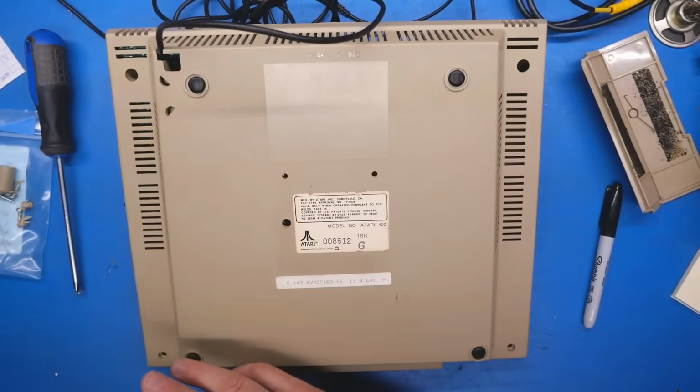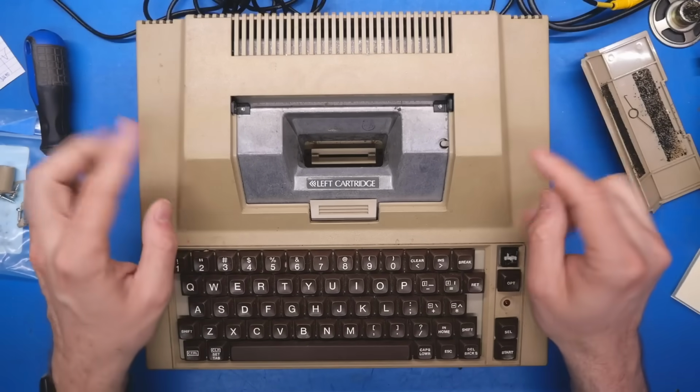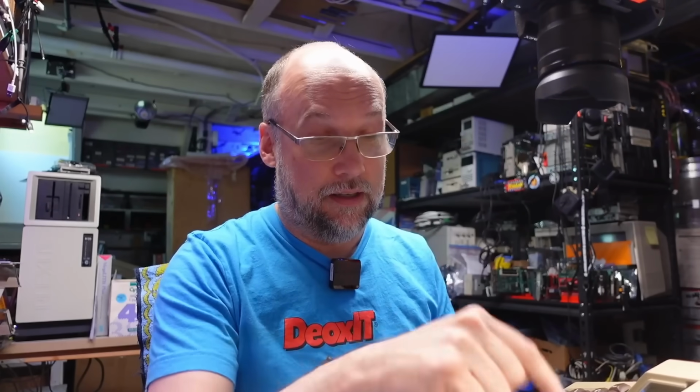Now this computer was Atari's low-end 8-bit machine and only ever came with 16 kilobytes of RAM from the factory. And it doesn't really have the provisions to be expanded to 48K, at least not officially. I know there were aftermarket modifications that allowed you to go up to 48K, maybe even beyond, but I'm not 100% sure a lot of people did those modifications, because I think the idea would be that you would buy the 800 and that was easily expandable to 48K or offered that way from Atari directly. And then you also automatically got the really good keyboard and audio video outputs. Yes, that's the other limitation on this, is RF out is the only way you can hook this up to your television. Of course, there are aftermarket mods that give you a composite video output, just like on the Atari 2600, but as a cost-saving measure, RF was the only output, at least from the factory.